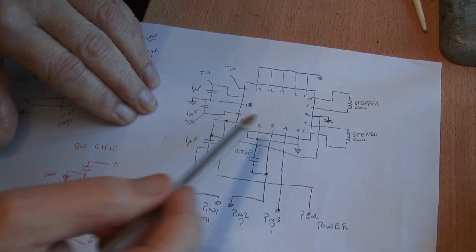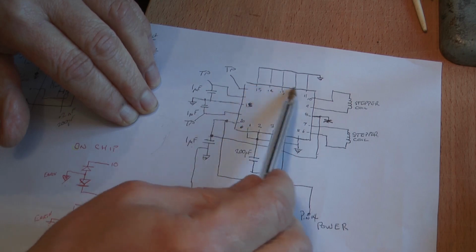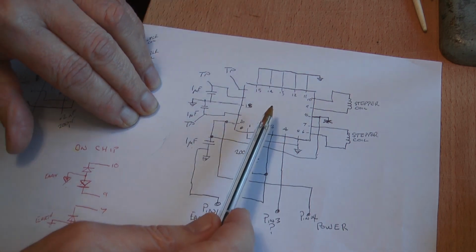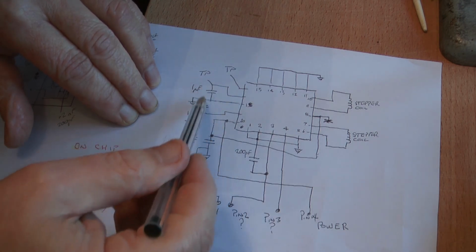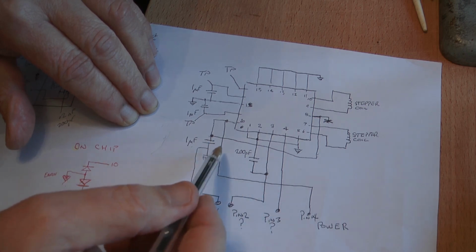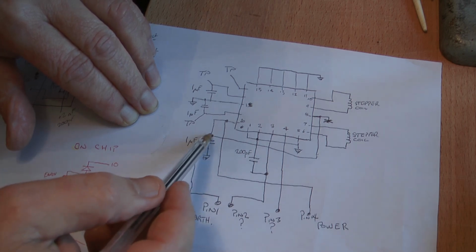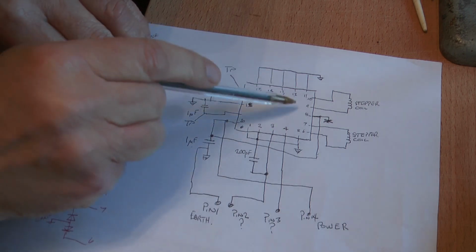There seems to be a lot of redundancy, but as I said before, I still think it's a stepper motor driver come microcontroller, and that these pins up here were probably used as a programming for the microcontroller, sort of putting the firmware on the microcontroller, prior to this device being soldered in. What the device is, I haven't got a clue. I don't know what the function of these two capacitors are here in the circuit. As we was discussing, pin 8 goes to pin 20 down to earth via a capacitor. Well, via this capacitor to earth, but more importantly, they go off to pin 4, which I think is the power input. So power is being supplied to pin 20 and pin 8.